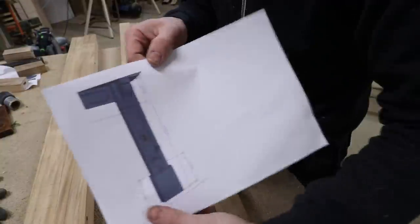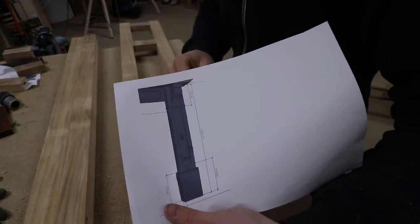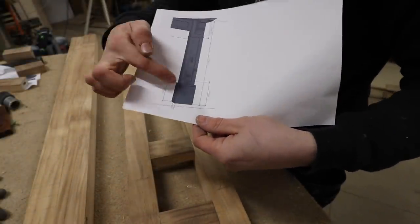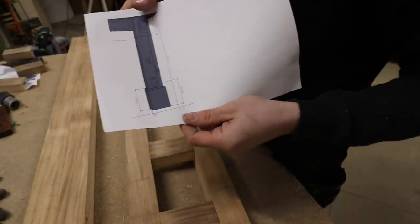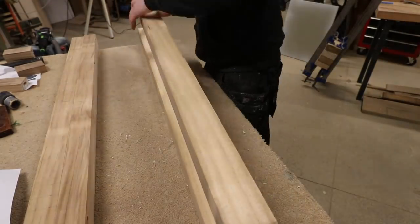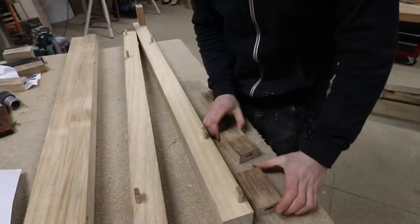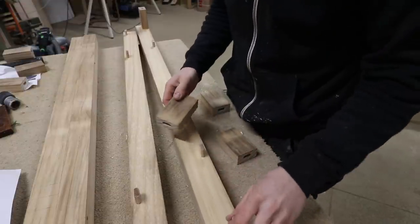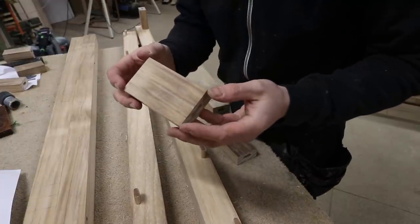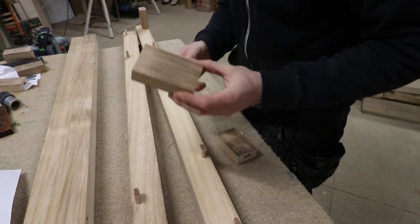These parts at the top and bottom aren't going to need anything to fill them in, because at the top we've got the corbel, which is just wide enough to cover the gap so you won't see it, and at the bottom I'm going to skirt round into the return to the sheet that's underneath the safe. What I will say when you're dealing with anything that you're dominoing, like a shaker style, is be really careful not to knock and damage the corners, because that's your joint line. Okay, so